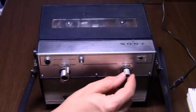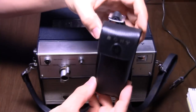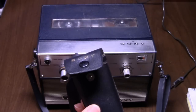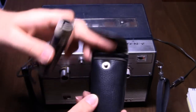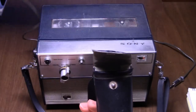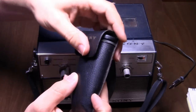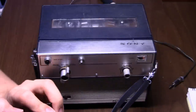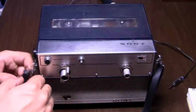The TC-905, when I first tried powering it up, made absolutely not one single beep from the speaker. My guess was probably leaky capacitors. I opened up the unit and found that two wires had been broken, although one of them may have been from me tugging on the top part of the case and caused a speaker wire to come loose, but another wire had already broken off previously on the speaker switch.